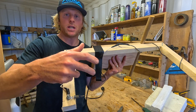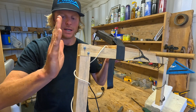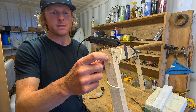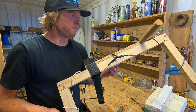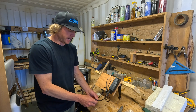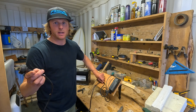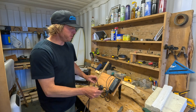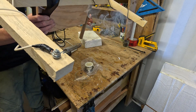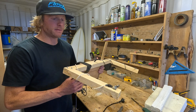I also found I was losing tension at the joins because the bolts were allowing the legs to flex inward over time. I went back and glued all of it and re-bolted it and that fixed the problem. The other thing that would be more convenient and safer is an on/off switch — just cut the wire, put it through a switch, and keep the charger plugged in permanently. Right now I just unplug it immediately when I'm done, but a switch would definitely be better if you're building one from scratch.